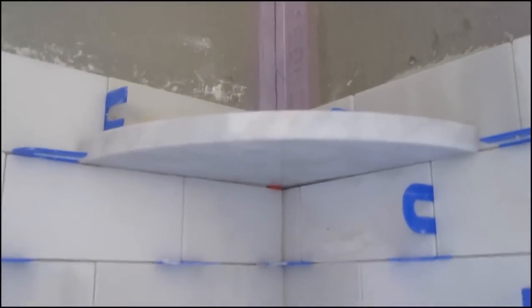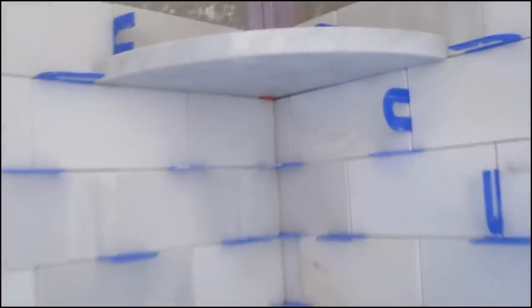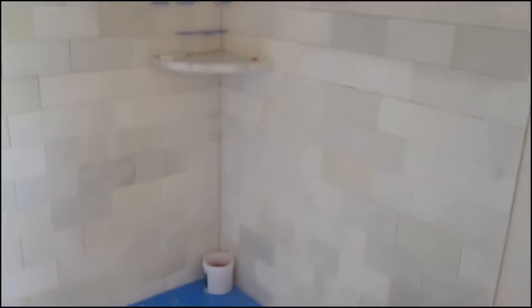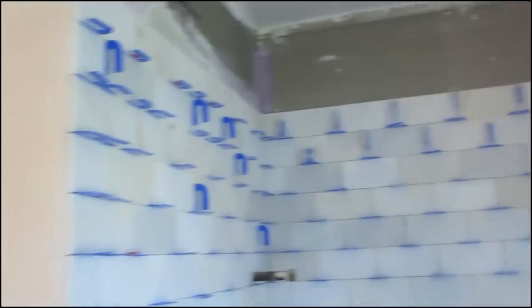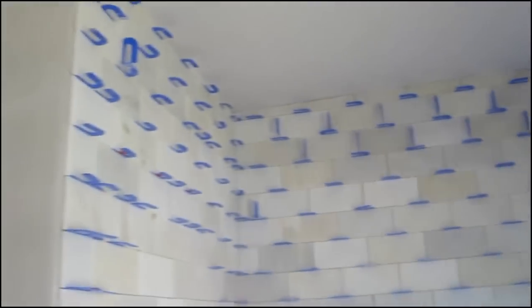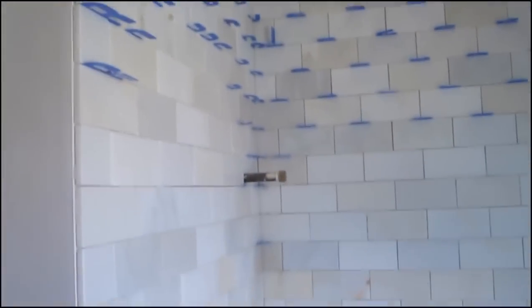Because of different shades, if you cut a tile, toss that piece, and then use another tile, it's not going to be exactly the same shade as the tile you originally cut. And because it's subway tile in a running bond joint, you want that corner to look as if it goes around — so it looks like it's folded. The 3x6 continues around the corner; if you put the two pieces that go into the corner together, they would still be a 3x6 tile.